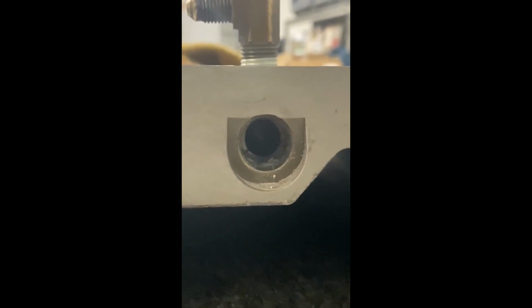Okay, bear with me. I don't have anyone holding my camera. I'm going to show you. I looked down his manifold. He's got a lot of powdery residue. Probably using a powdered soap. I would suggest using a liquid always. I like Sager's Deep Blue. Great. All my filters come out. They look good. So I'm going to clean this up. I have this brush here. I get this from Harbor Freight. They come in packs. Just a little wire brush. I'm going to give it a quick cleaning, and then we're going to assemble this head.